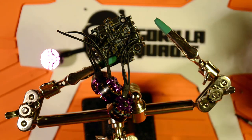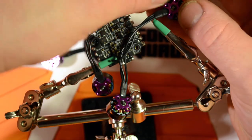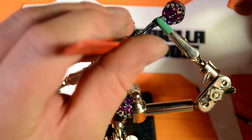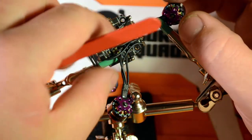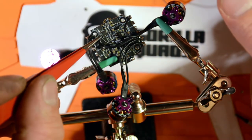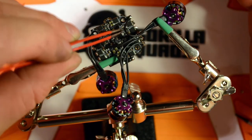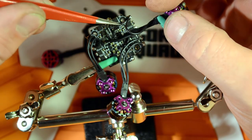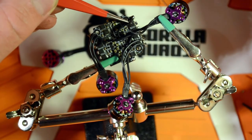That sucks. But in my opinion, if you were only going to be able to afford to buy one soldering iron, instead of going to, I don't think Radio Shack exists anymore, but one of these brick and mortar stores that sell soldering irons, you're going to end up with probably a piece of crap. A little 15-25 watt soldering iron that's barely capable of maintaining heat. And it's not just the max temperature it can get to, it's a thing I think is called reserve, which is basically how long the soldering iron can keep giving up its heat without dropping its temperature.